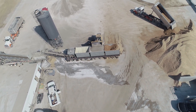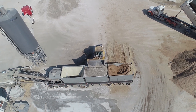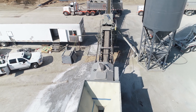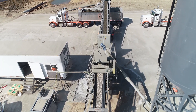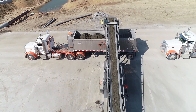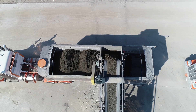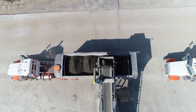Production starts much like conventional concrete with the same basic ingredients: aggregate, cement, and water. However, the quantities are different. Once loaded into a hopper, materials travel up the conveyor belt to a twin-shaft mobile concrete batch plant mixer capable of thoroughly mixing zero-slump concrete in high volumes. Once batched, the low-slump mix is loaded onto semi and dump trucks which are then sent to the jobsite.